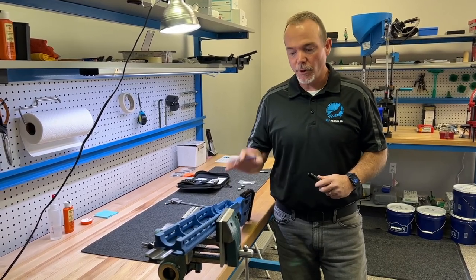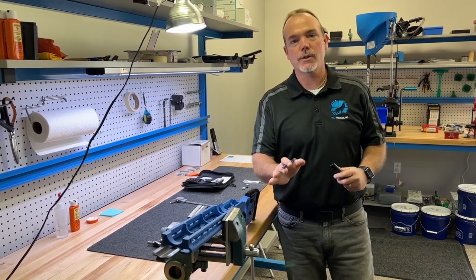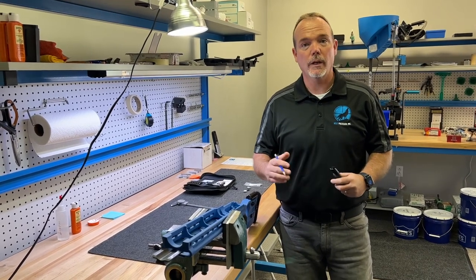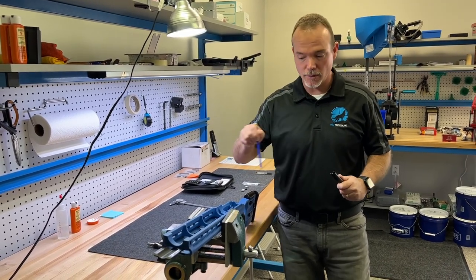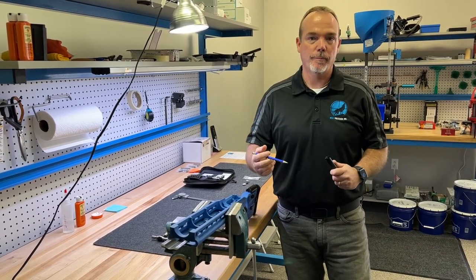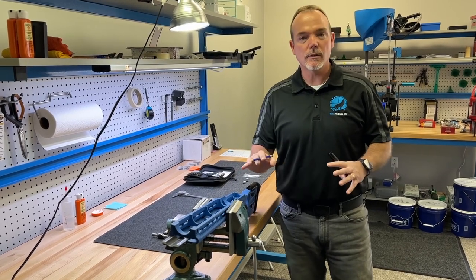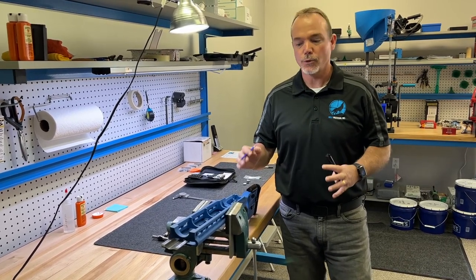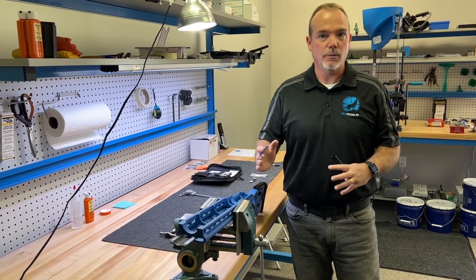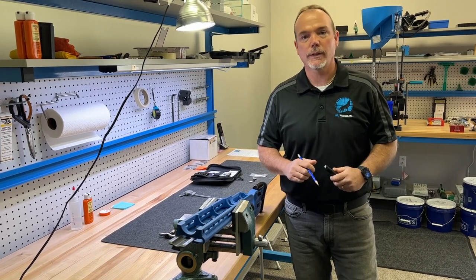And this is a perfect example of just what we look for and why it's so important. So we get these questions all the time. We had 5 emails today about selling barreled actions, and we don't. The reason being is this issue that happens right here. When we deliver a rifle, it has to perform. And without us being able to check the stock and work on it and do these little things to allow the rifle to shoot to its fullest abilities, there's always that potential that the customer puts it unknowingly into a stock that actually needed bedding and the rifle's not going to perform.